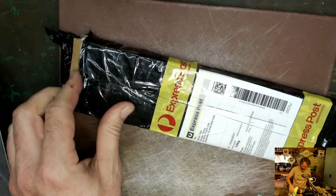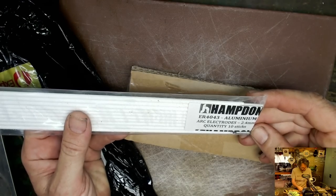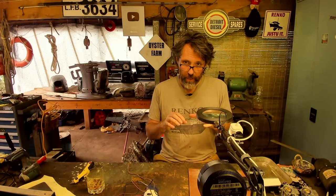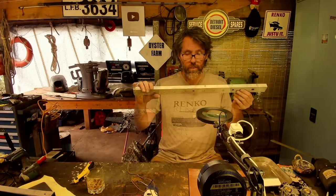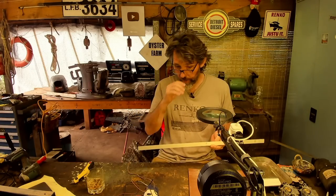Let's open up this package — Hampton 4043, 2.4mm rods. I'm going to grab a bit of aluminium and put a flap disc on the grinder so we can get that oxide off. The oxide coating on aluminium is very hard and has a much higher melting point than the aluminium below it, so it's really good to get it off when you're welding. Here's a scrap of aluminium I'm going to use — it's about three and a bit millimetres thick.